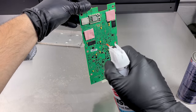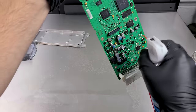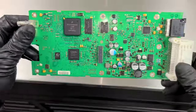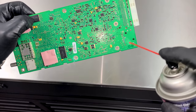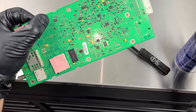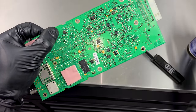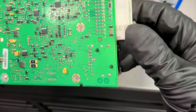In some cases you'll see the corrosion just kind of disappear. Do one pass front and back. At this point it's just dripping - before involving the toothbrush, just kind of blow it dry gently. The electrical contact cleaner evaporates very quickly. If you don't have any source of pressurized air you could just let it dry for a few minutes. Then look over the board for any remaining corrosion - some more concerning corrosion remaining can potentially cause a short. Spray that area, then very gently use the toothbrush to dislodge the contamination, because it can cause interference in the circuit board and cause shorts.